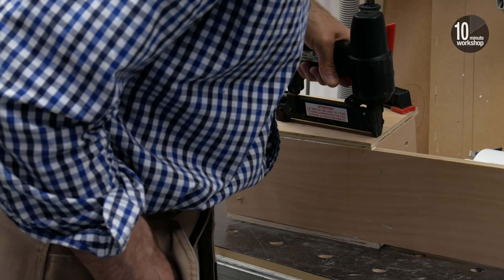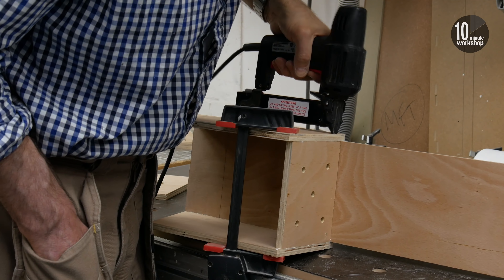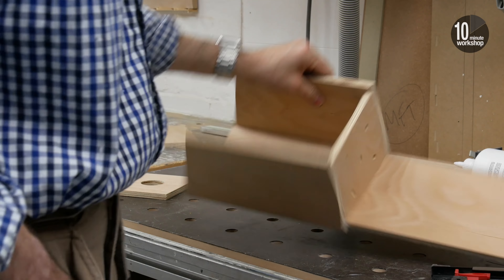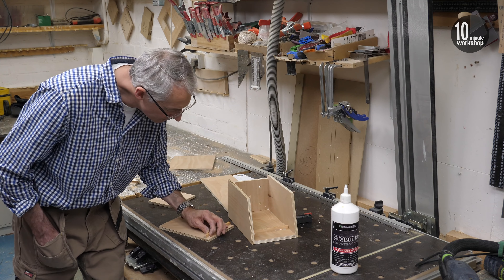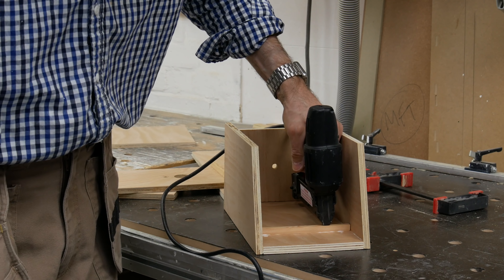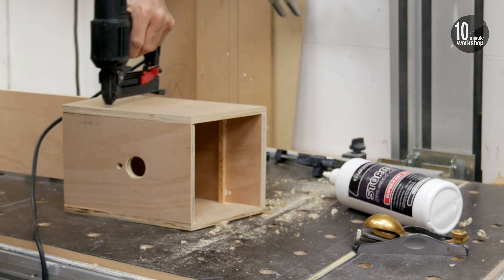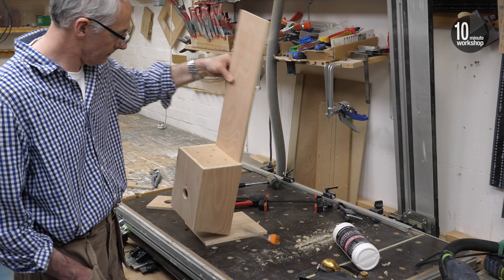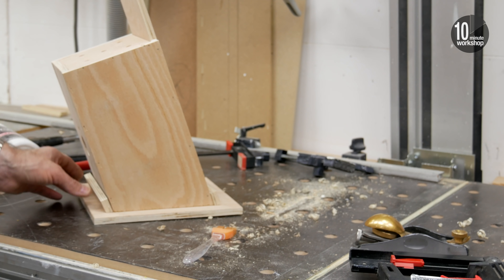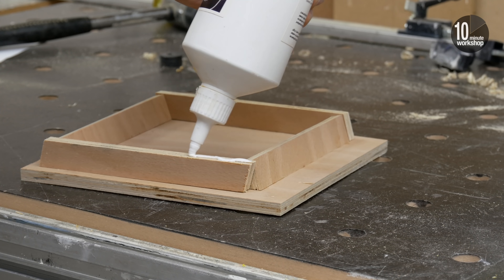Then the base with the drainage holes goes in. Then I'm fitting the little strips to the inside faces of the bird box front and back - this is where the camera shelf will sit. And finally, the front gets fitted as well. You can see where I've also drilled a hole for the dowel perch. The brads are plenty strong enough to keep everything together while the glue sets, so I've upended and centred the box on the lid, and I'm gluing on the angled strips that I cut earlier to the front and the rear.